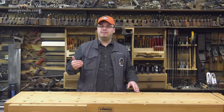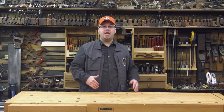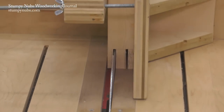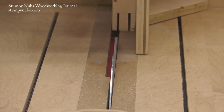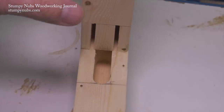This time I want to show you how the tenon jig works. We'll cut a standard tenon and a double tenon, and you can use these same skills to cut bridle joints, half laps, and related joinery. Even if you don't use my sled and tenon jig you'll still learn some skills that you can apply to other table saw tenon cutting jigs. So let's get started.